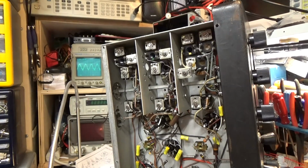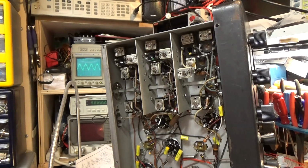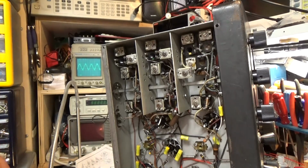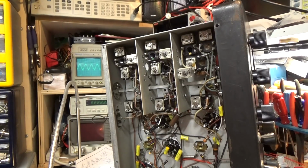We're going to turn off modulation. They just want 455 kilohertz, and you're going to align the BFO to be 455 kilohertz as well. And to create that CW tone that you hear, you adjust the pitch control by throwing off the BFO from the 455, and the two frequencies beat together, and the difference between them creates an audible tone. By adjusting that, you can change the pitch of the CW tone when you're listening to Morse code if you want it to be a higher or lower note.